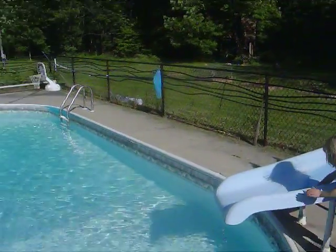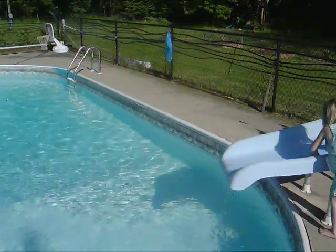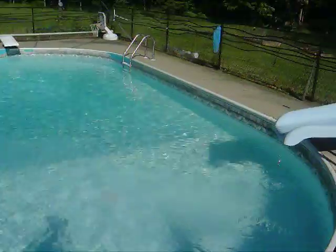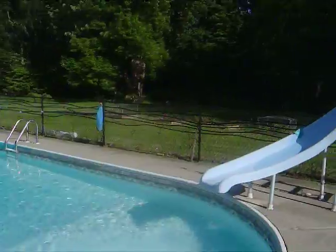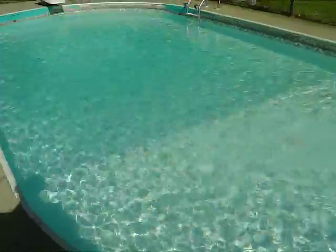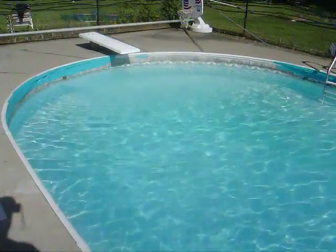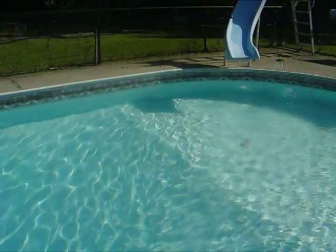You can see the water coming back into the pool — granted, it's just a dribble, but I can increase that slightly. If you increase it too much, it comes out the same temperature, but normally it's about five degrees higher. If I put more headers — another set of headers and another five strands of black tubing — it would get even hotter. Basically, that's how you tee off your main pump. I don't know every single configuration for every pool out there, but that's how you get your pool up to a good temperature.